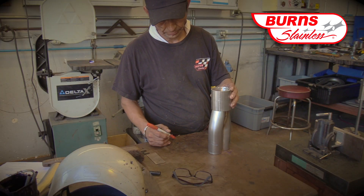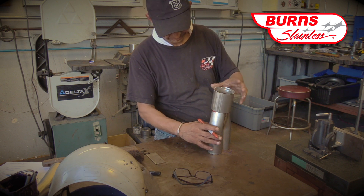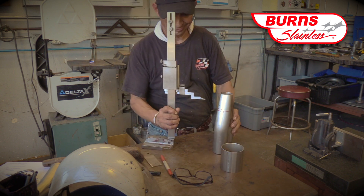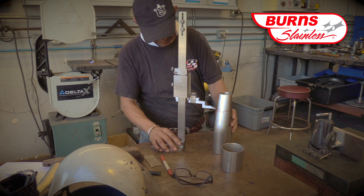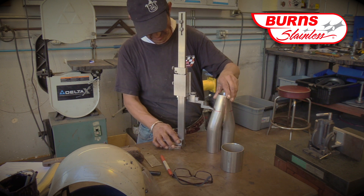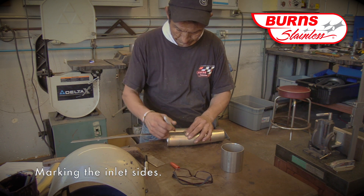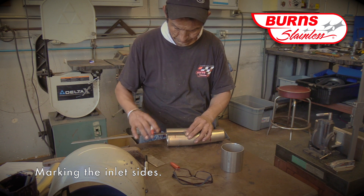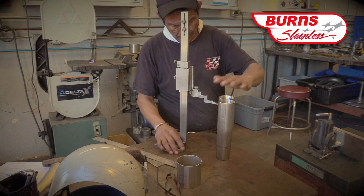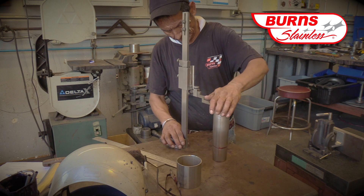The next step is to cut the collector for the inlet and the outlet. On the outlet, Fernando is taking a piece of tubing and placing it down the end of the collector. In this case, we are wanting to make this a 3-inch outlet tube. He sets it down and places a mark with his Sharpie at that location. We will actually add one quarter of an inch to that position and score using the height gauge at that point and make the cut there. On the inlet side, we usually put 2-inch slips on our collectors with a quarter-inch gap between the start of the bend and the slip, so we want the leg lengths on the inlet side to be 2.25 inches. Fernando is using the height gauge to score the cut line on the inlet side.